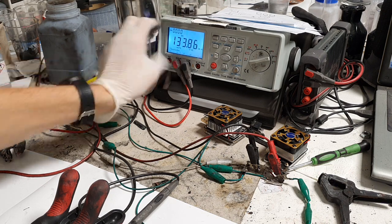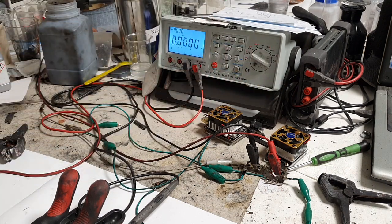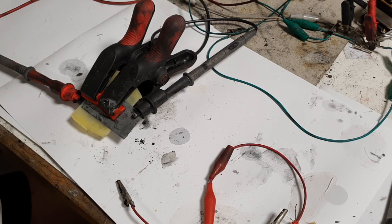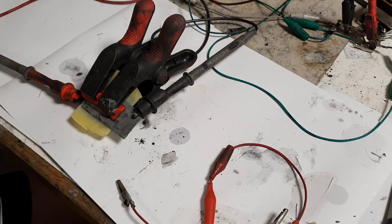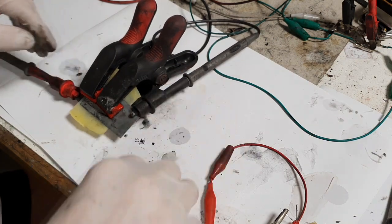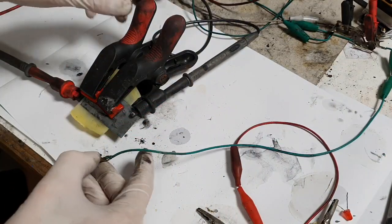Really impressive. If you boil the potato for 11 minutes the internal resistance will be lower. The raw potato has higher resistance, but the boiled one has lower resistance. Now I'll put this on the electronic load to see what I can get out of it.